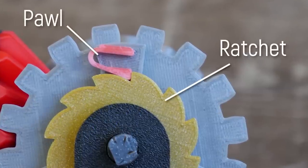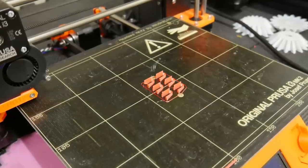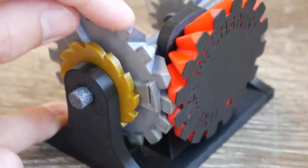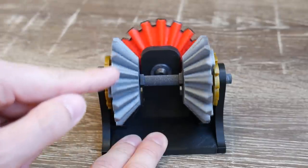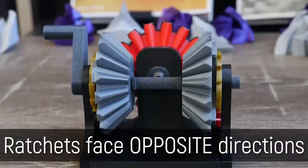The ratchet and pawl permits movement in one direction only, while free spinning in the opposite direction. I 3D printed these little pawls separately because they're fairly delicate — I allowed for three in the design, but it seems you only need one for the mechanism to function well enough. These are then secured to the bevel gears. The bevel gears mate at 90 degrees and, like almost all gears, rotate in opposite directions to the gear they're mated to. Because of this, it would be impossible for this mechanism to turn if both grey bevel gears were fixed to and driven off the axle — the whole thing would just bind up. But instead of being fixed to the axle, the bevel gears in this design are free to rotate on the axle independently. Instead, the ratchets are fixed to the axle with a keyway, and they face opposite directions to one another, which is really important.